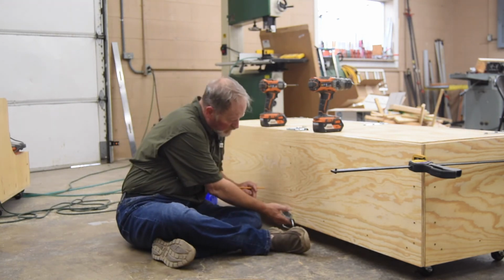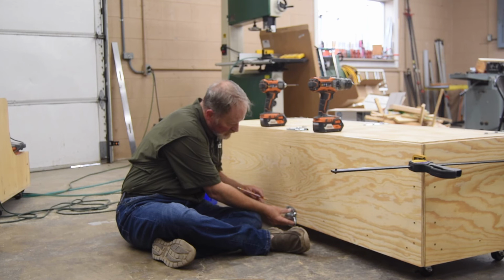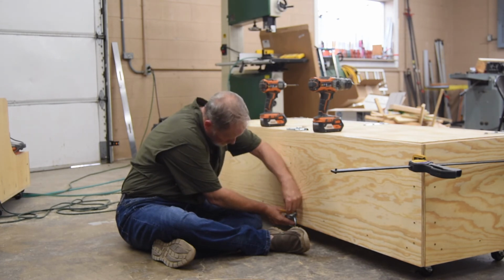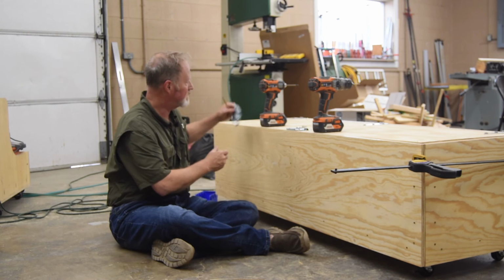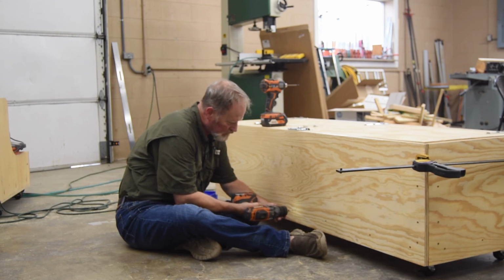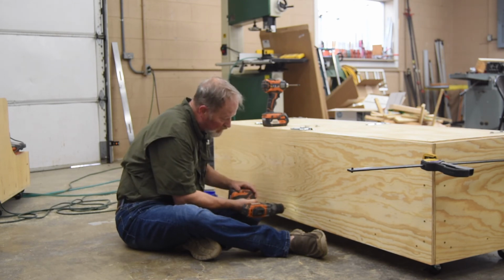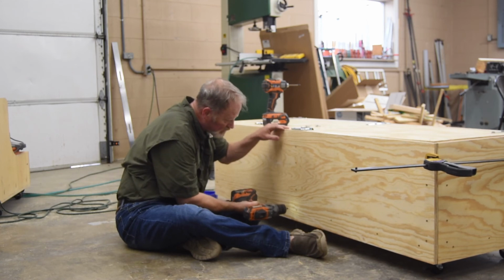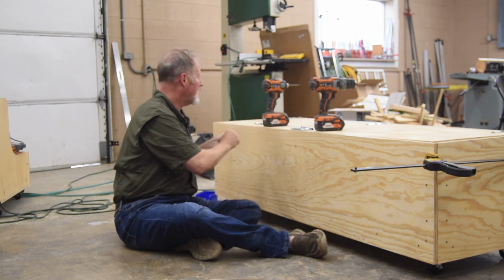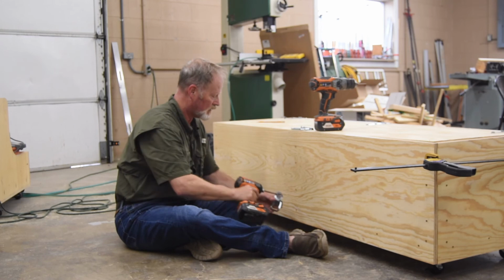So, what I want to do is place him. These screws are in the middle, so that's fine. I'll just locate this. I'll eyeball this just so that the steel on both sides is centered up, and I'll mark the first 2, drill the pilots, casters work pretty good. And then I'll set the first couple of screws and use these to position the piece so that I don't have to hold it in place by hand.